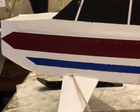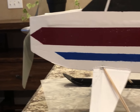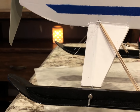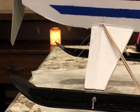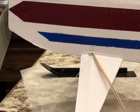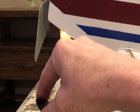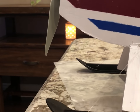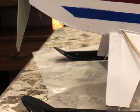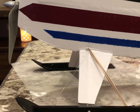You can see now that as the plane comes up on taxi, it comes up level, the skis are still level and won't drop below level — so you're not going to catch a ski tip and flip the plane. You still get plenty of spring going backwards. The elastic will keep it pretty tight, but the fish line will never let it go down far enough to grab a ski tip. So the next thing we need to do is put a wing on it, put a battery in it, and see how it works in the snow.